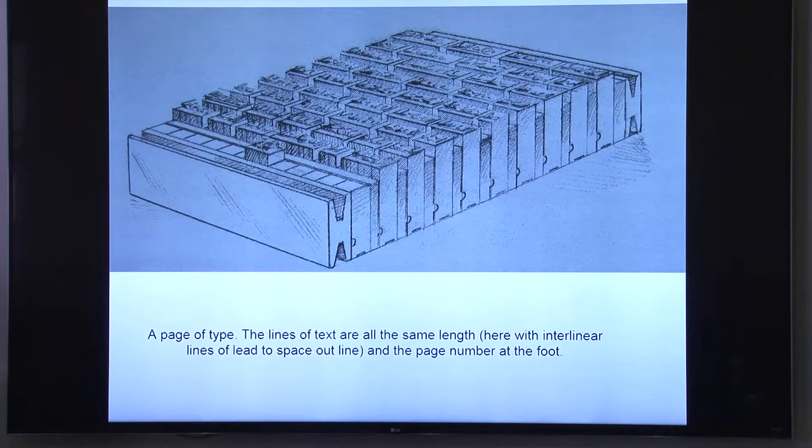The lines are assembled into the text block, hopefully all set to the same tension, so exactly the same length. Otherwise, there'd be problems with lockup. You can also see the M's used as spacing around the page number in the bottom line on the left of the image.